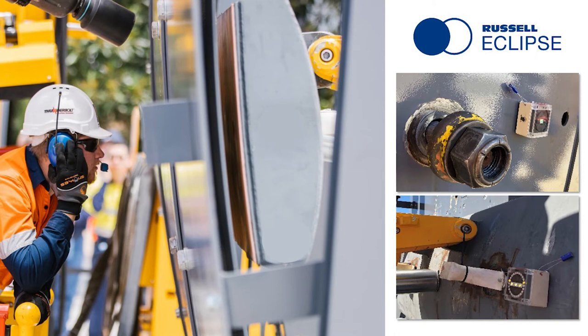One thing that is difficult for the guide to communicate is the angle of the liner. When you're looking through the hole, you can see the position quite accurately but can't necessarily see the orientation. So we have a little device we call Eclipse — a very simple device magnetically attached to the outside of the mill in line with the bolts, measuring the bolt angle. Another device with a display is attached to the liner or integrated with the grapple, and they communicate to each other, giving a simple visual feedback to the operator when the liner is precisely aligned in that axis. The crew we first used it with didn't want to give it back — it was beneficial even for traditional placement methods.